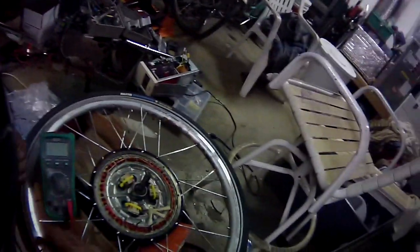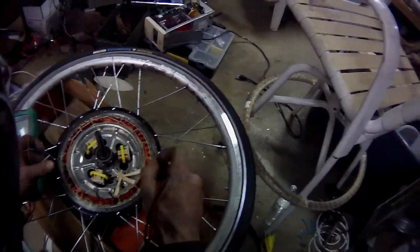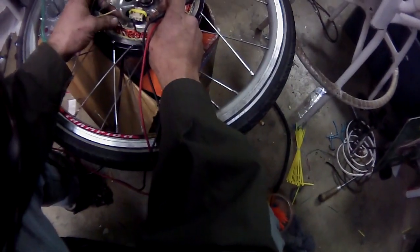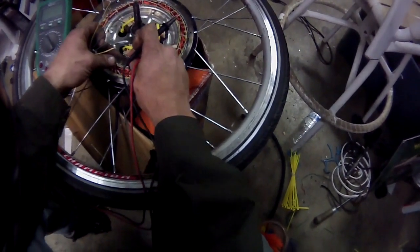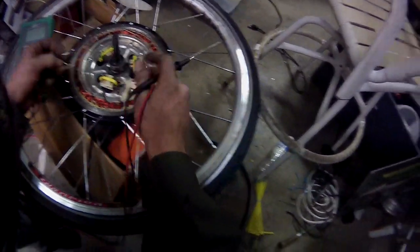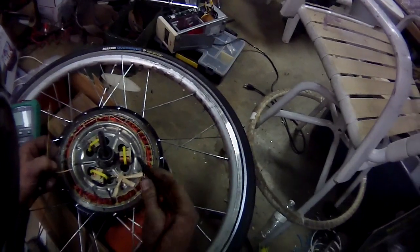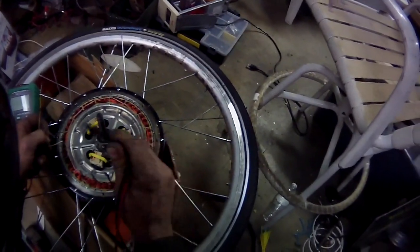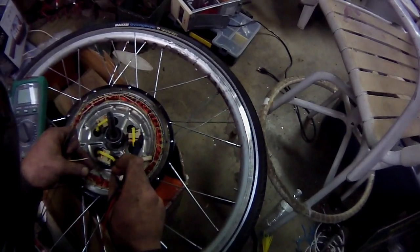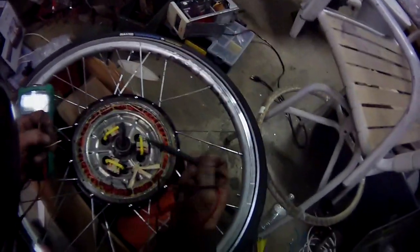So what I've done is I've located the back end of the factory winding where they wind all three of the phases together inside. Usually they're clumped together and soldered because when these motors come out of the factory they're all connected together — that is your star configuration. What I'm going to do is remove the sheathing here and through a series of wiring have a relay switch from having these wired all together to having them wired across one another. That's called delta.